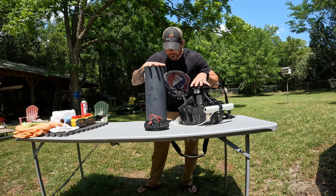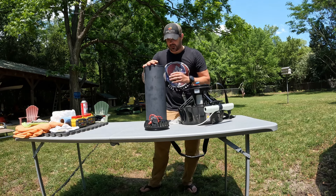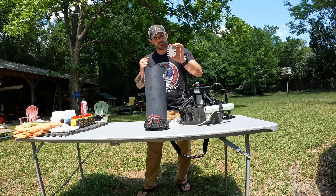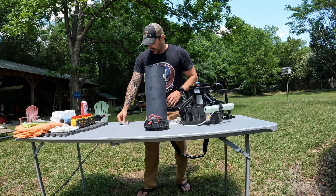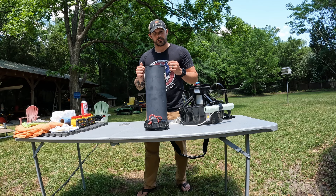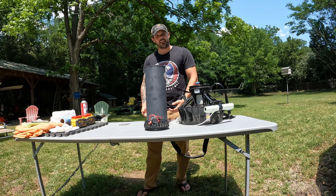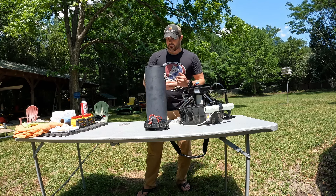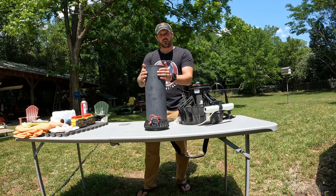As a disclaimer, I have already messed with this a little bit out of the box, so there are some things that kind of go in here that I've removed. The saltwater trim plate attaches inside of the DPV body. Also there are tire weights — the sticky adhesive kind — on the inside of the tube when it comes from the factory. Normally these weights, as far as my experience has been, are down by the tail end, which obviously makes the tail end a lot heavier. So immediately what I do is I remove those adhesive weights and move them to the nose end.